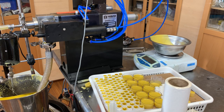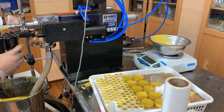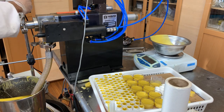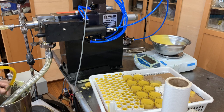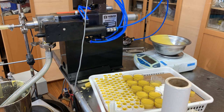To clean it, you'd want to turn all this off. We have to keep a mixer in here because we have particulate in the product — there's no use letting it sink to the bottom. We have this electronic thermostat in here which we can attach to the stove, which I did not attach, and that caused some of my problems. We don't want any restriction when doing this part, because any wax is solidifying in the hose. If it's not coming out, take the hose off and soak it — you don't want so much pressure that it pops off and shoots hot wax everywhere, which it will.